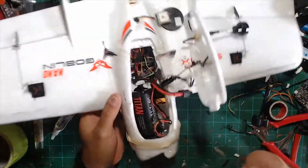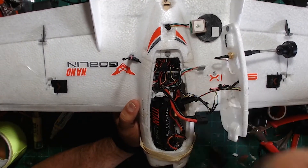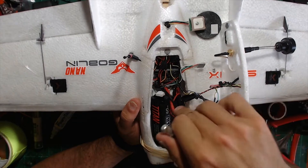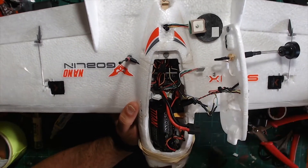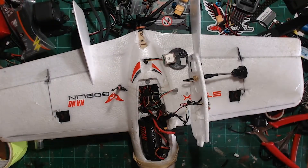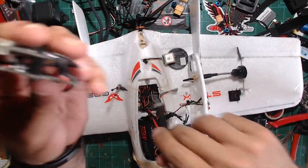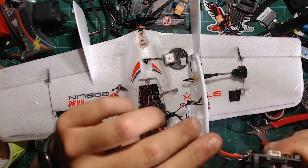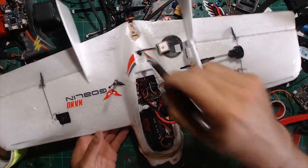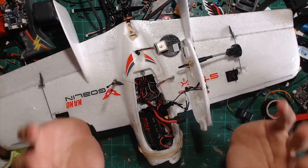I liked having the pins this time. I put servo connections on everything so that everything can be plugged in, and if I have a problem with the board it'll be a lot easier to de-install — all I have to do is unplug everything, put in a new board, and plug everything back in. As compared to the Omnibus, I had this kind of a mess with the PDB. A lot of new boards are going this way with big backpacks, and in a build as tight as the Nano Goblin, I've cut the top off like three times to replace the flight controller.